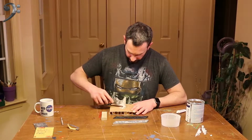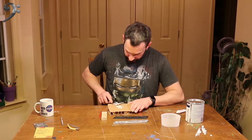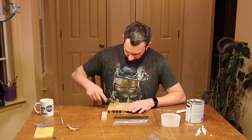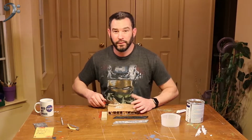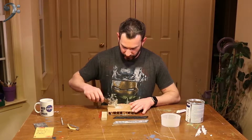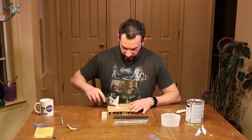And this has an open time of about 10 minutes, which is not very long, and you'll be able to tell when it's starting to really work because it actually gets hot. The chemical reaction between the two epoxy components creates a little bit of an exothermic reaction, so as soon as you can feel it getting a little warm, you know your time is starting to run out.